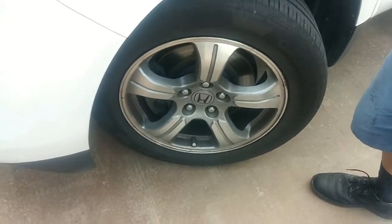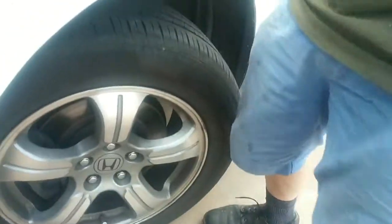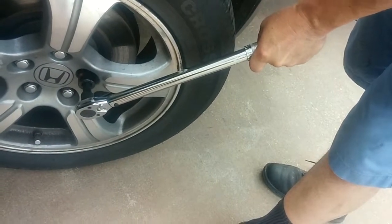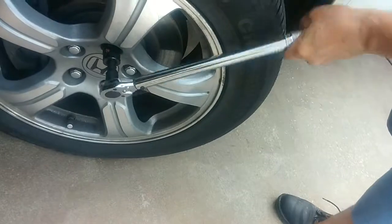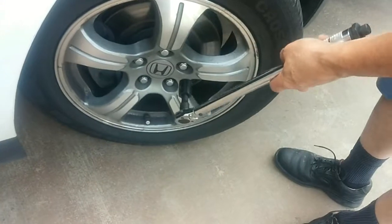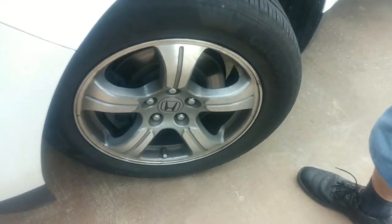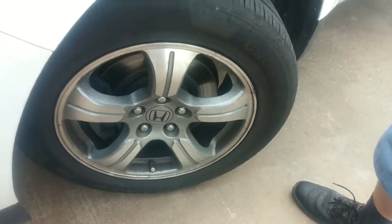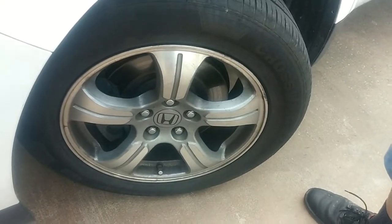What I'm going to do is loosen up a couple of lugs and bring it to 80. All these lugs, before I loosen two of them and re-torque them at 80, were over 100 foot-pounds of torque — that goes beyond the manufacturer's specs. When these tires were rotated, they were probably rotated using an air-powered impact driver, and the guy doing the rotation didn't apply the final torque with a torque wrench.